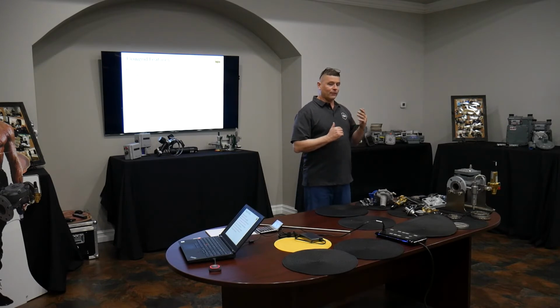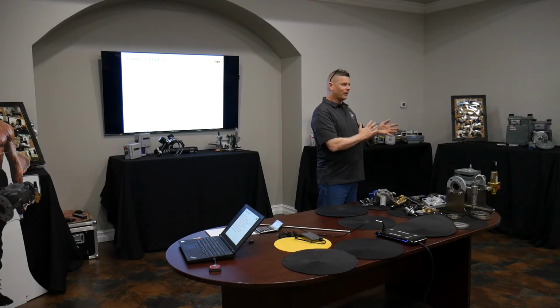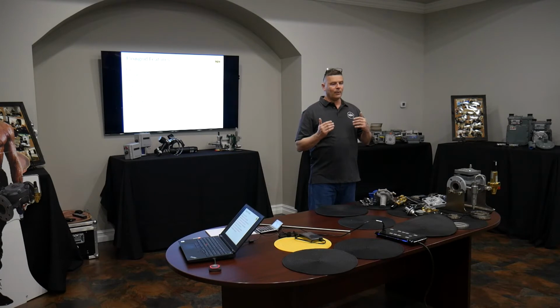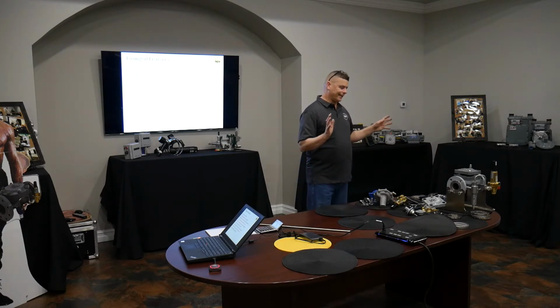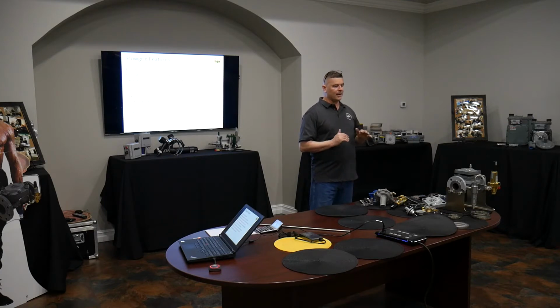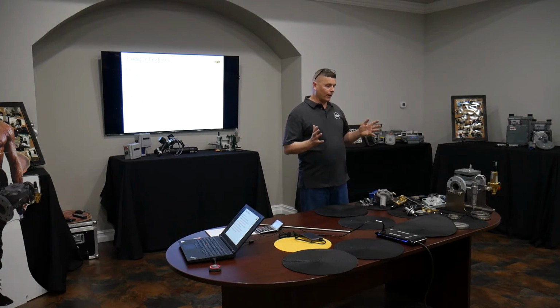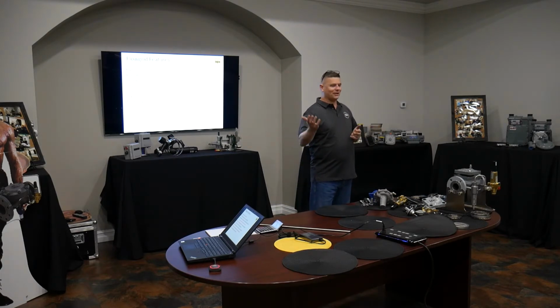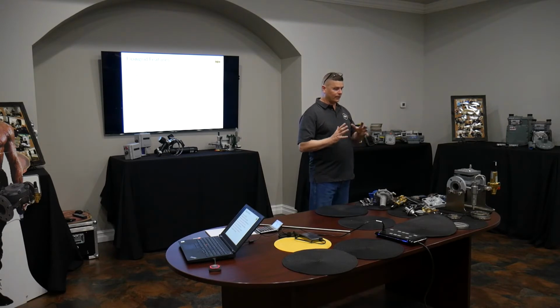We've got Flow Grid 250s, which were with cheaper components. It could only handle 250 pounds max pressure. We have standard ports and large ports, and I think they decided that it would simplify and reduce their overall requirements of what they had to maintain by settling on certain things in the 2-inch realm. They also had the 2-inch added capacity, which they brought in as a way to try to keep in a 2-inch body and not go to a 3-inch, because it has a bigger throttling area, a 3-inch throttling area.